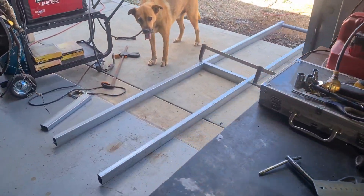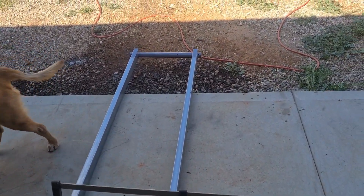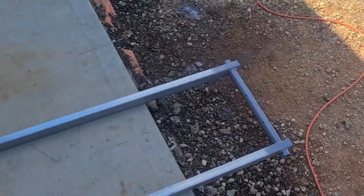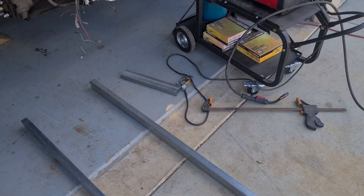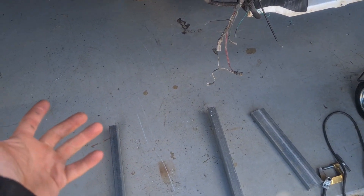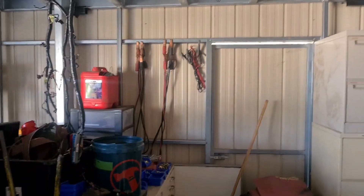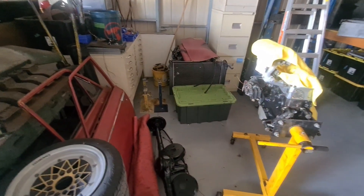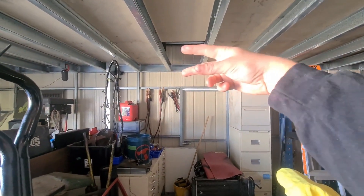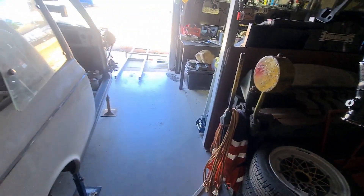Painted stuff, welded and painted - looking good. So I did actually expect to be out of welding gas by now but I'm not, so I'm gonna do something that doesn't require welding. I'm gonna bolt this into place, which means drilling holes in the purlins, and then I want to get the bottom rung step welded in because that's gonna be on a weird angle going from here to the floor. All of this has to move, so I'm gonna move all of this, drill two holes up there, then drill eight more holes up there, bolt everything in, get the bottom step lined up with the floor, tack that in, probably take it all down, and then weld all the other steps in.